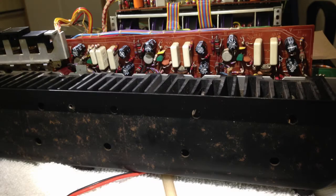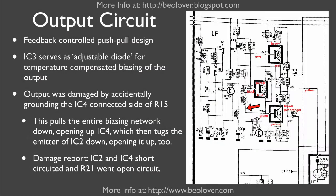Here's a shot of the other three amplifiers, and here you see the new electrolytic capacitors. Now it is time to give that quiescent current adjustment another try, this time with an insulated screwdriver. I elected to measure it across both of the output resistors, because one can simply connect the red lead of IC2 and the brown lead of IC4 with two grabber clips, giving safe access to the quiescent current going through the output.